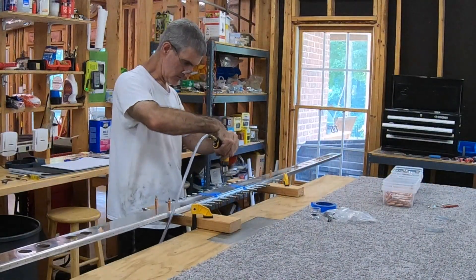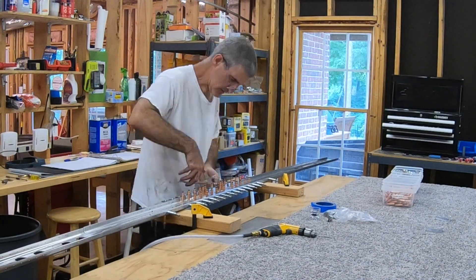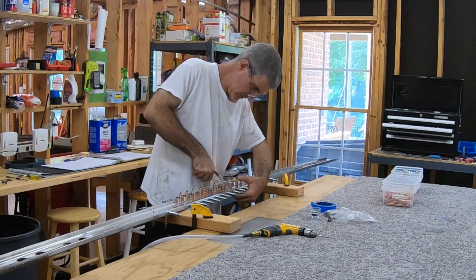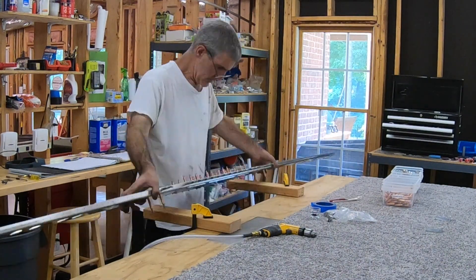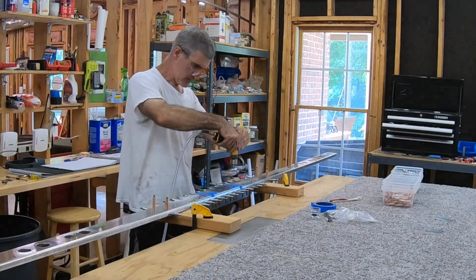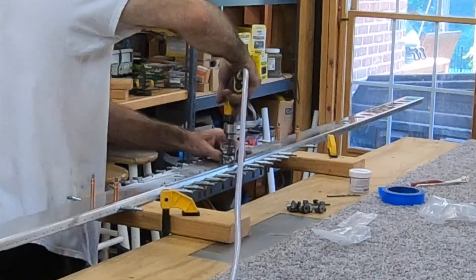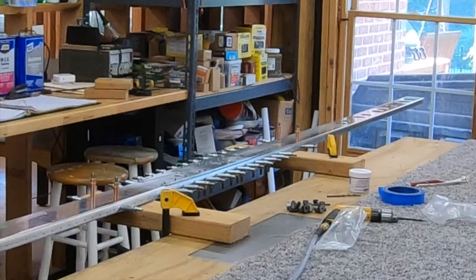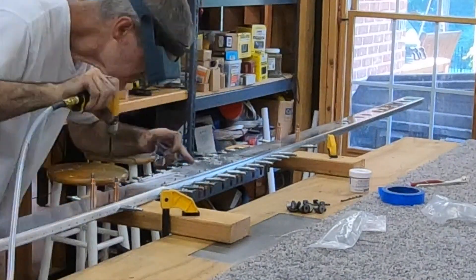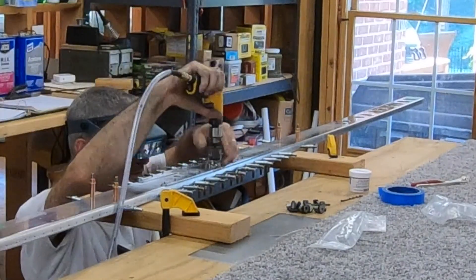Fast forward to the following weekend — I'm wearing my nicest t-shirt. This video is getting kind of long, but there are really only a couple more steps before I went ahead and primed all the parts for the front and rear spar assembly. Here I'm final drilling some more holes through the doubler and the spar web, and match drilling some of the larger holes — final size is a number 12 — through the doubler web and into the spar cap, using a new little tool I bought for myself.